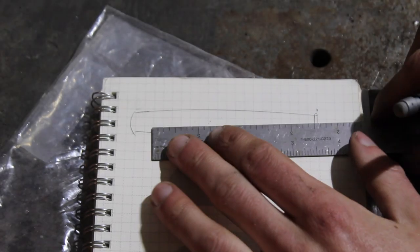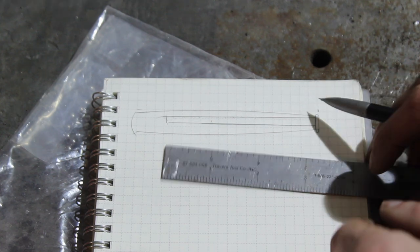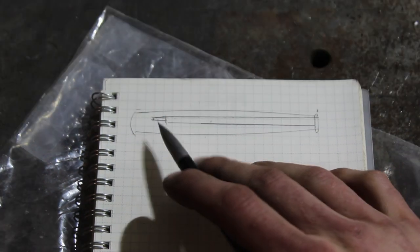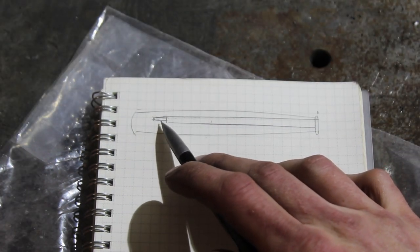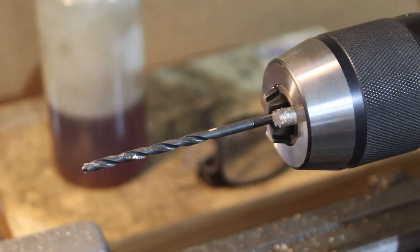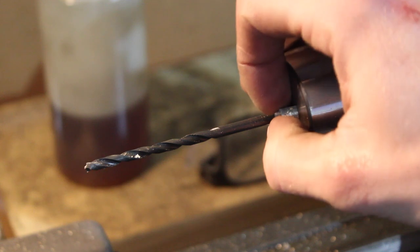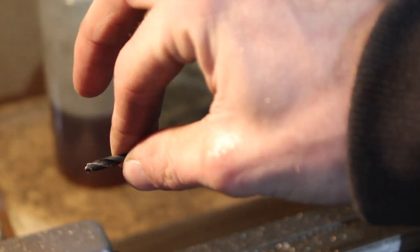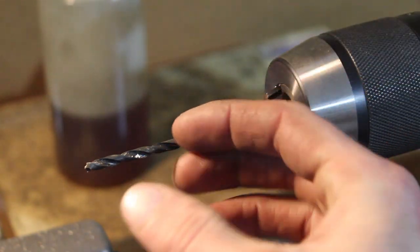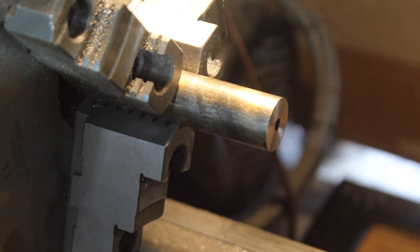So here's what we're working with. I think this would be easier if I just draw it out. So that's our bore — 3/16ths of an inch — and I want a pocket behind that that's a little bit narrower. To machine that pocket I need to use a smaller diameter drill bit. The problem is most of my drill bits that are smaller are pretty short. So I've got just a little bit in the drill chuck and I'm just going to hope that works — it's in there pretty solid. I only need to drill maybe about a quarter inch of depth, all the way at the very end, so I'm going to use as much of that drill bit as I can just to get back in there.